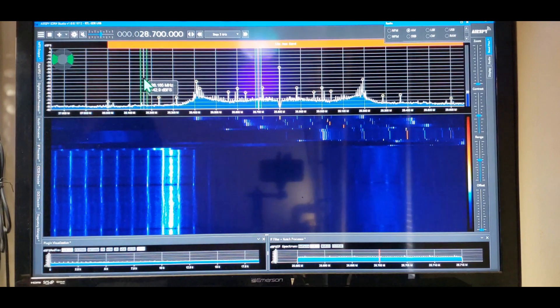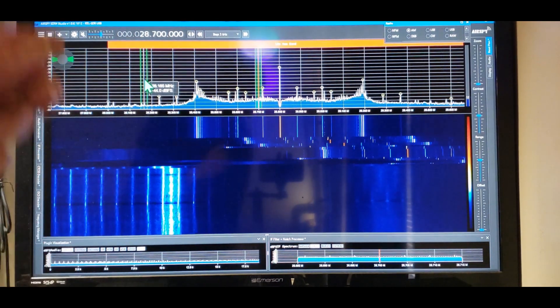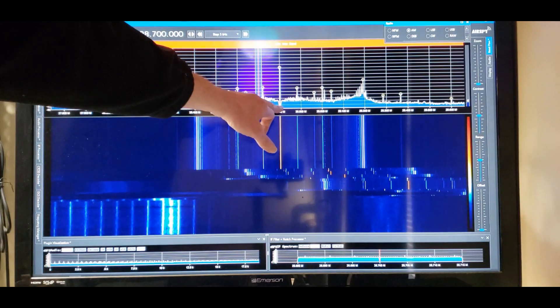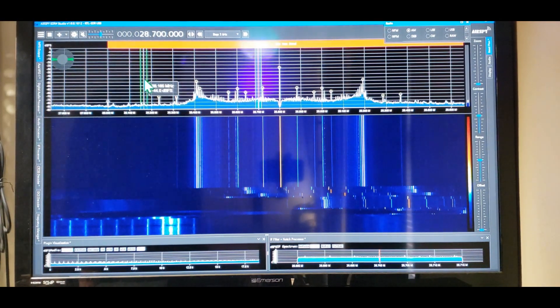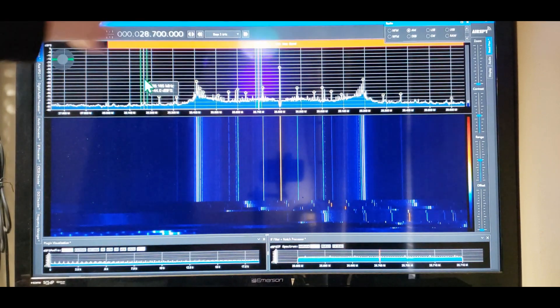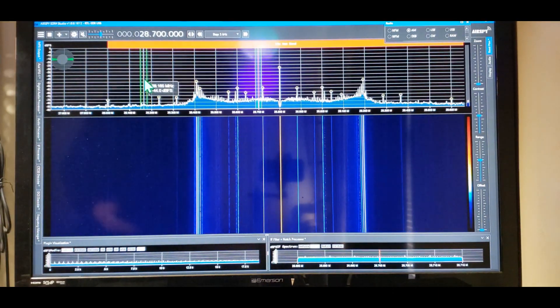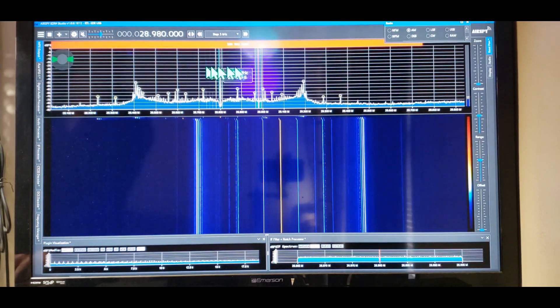Let's try to go further — but here's 10 meters, and I call this the cone of death. Look at that — if you know what that is, let me know. That is backwards modulation, peaking hard and killing my whole 10 meter band. I can have a little bit on either side of it, but that noise is in my location area. It might be a power line or a big power line capacitor but it will not move.